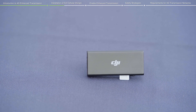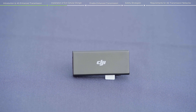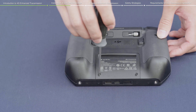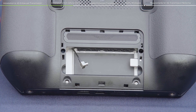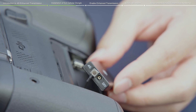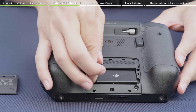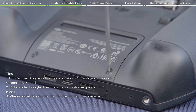To install the DJI Cellular Dongle on the DJI RC Pro Enterprise Remote Controller, insert the nanoSIM card purchased separately into the dongle. Use an AH 1.5 screwdriver to remove the screws and open the cover using the gap on the bottom left. Connect the antenna cable inside the remote controller to the antenna port marked with a 4G symbol on the dongle. Place the dongle inside and push it right until it connects with the USB-C connector, then reinstall the cover and secure it with the screws.